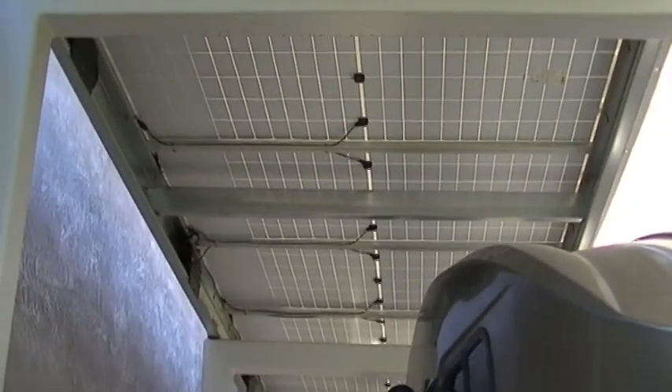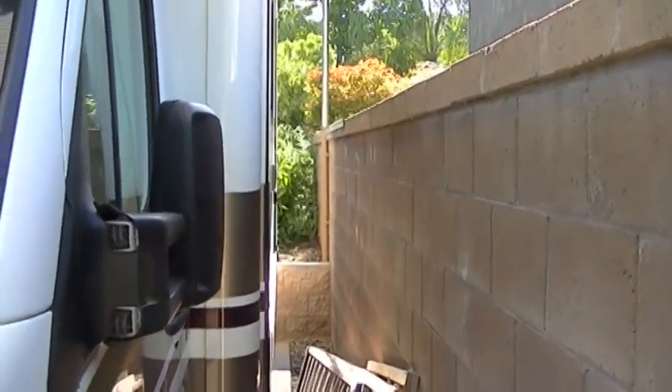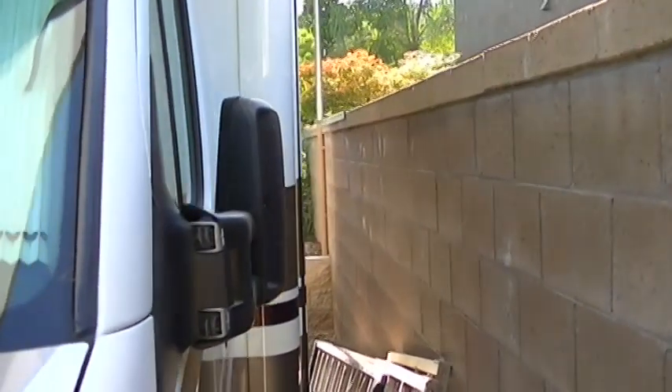The system works out really well for this customer. We wished we could have added another row of panels, but let me show you the fence line — there's enough room on the front but the back is angled in towards the house by several feet. By code we have to be three feet away from the property line, so we could not put an extra row of panels on that side. That's why we used the solar mesh to give them more shade for the RV.